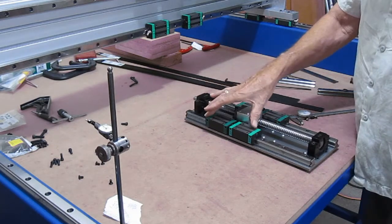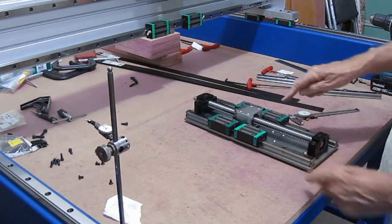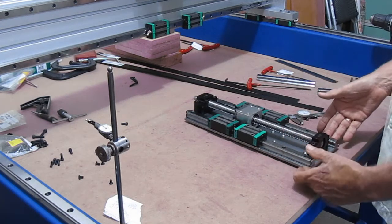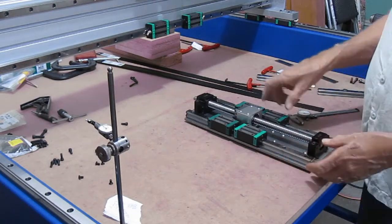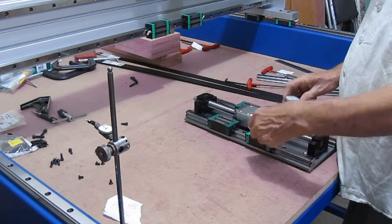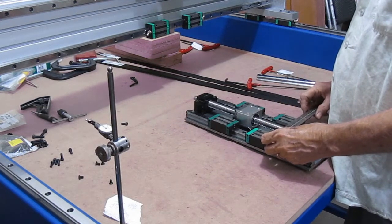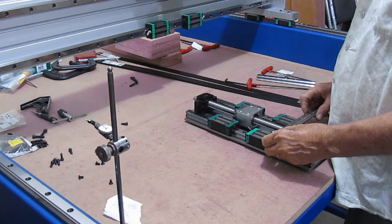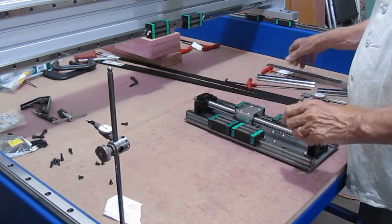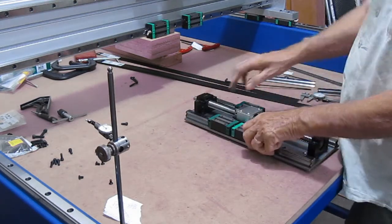Remember, I can't go much farther than that, I'm still waiting for my spindle mount. Remember, I mentioned that the spindle mount plate and my axis mounting plate were cut from the same stock, which is only 6 inches wide. And I guess an error on my part, I didn't take into account the overhang of the bearings. So it says that I need roughly 6.5 inches edge to edge, 6 1/4. I'll go with a nominal size of 6.5 wide. Maybe I'll go 6.5 square.